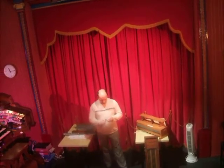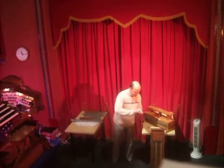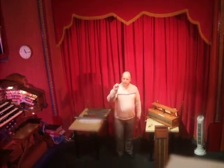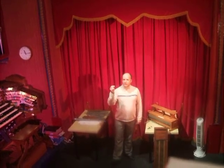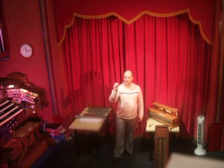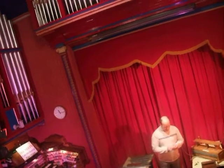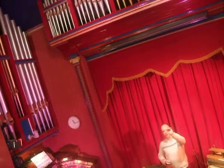What does the magnet do? Inside the cap, we have that tiny little piece of metal with a very thin piece of leather on one side, and that is what makes every single thing in this organ work, whether it is a hammer on a xylophone or a drum, or the valve under a pipe. The leather on the one side is simply to give a good seal against the inside of this cap, which opens to the outside air.